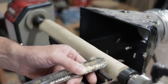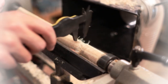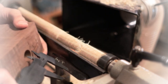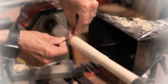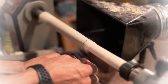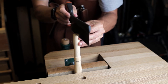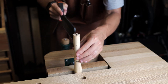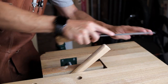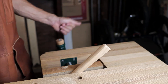Anybody who's watched my other videos knows I'm really not a good turner. Basically I started out making sure the end that's going to go through the head matches exactly, then I leave a little extra space. For the actual handle part, I start at one end and work my way to the other. There are still flats on each side, so it's not a perfectly circular handle — it's got a kind of rectangular cross section. I added a couple of embellishments, just a couple of burned-in lines, and then cut a curve for the wedge at the top, with a little more shaping to the bottom of the handle.